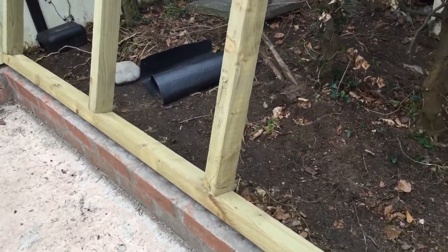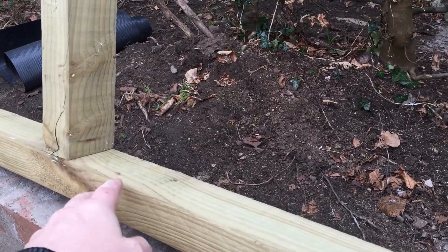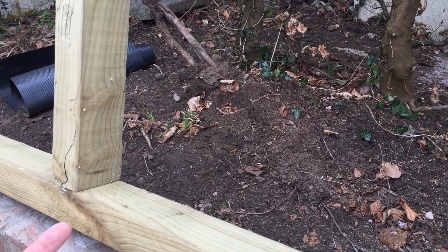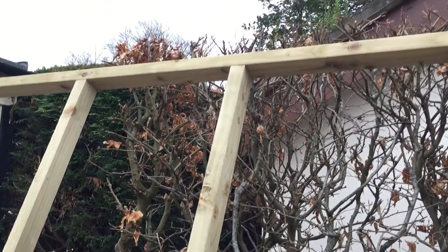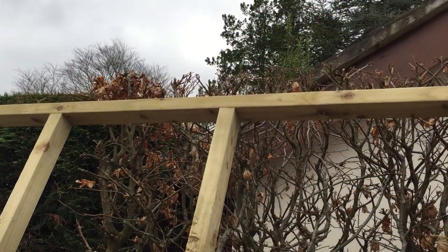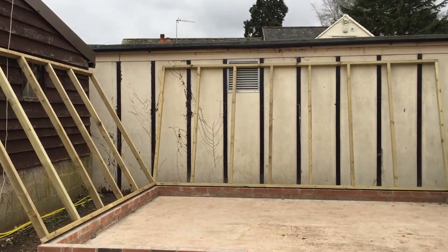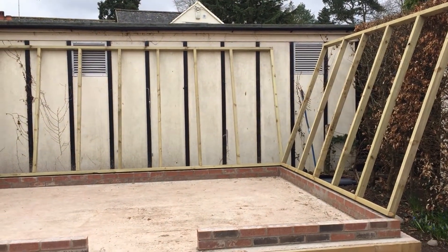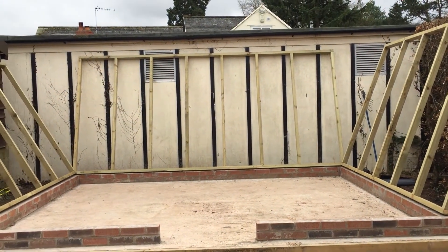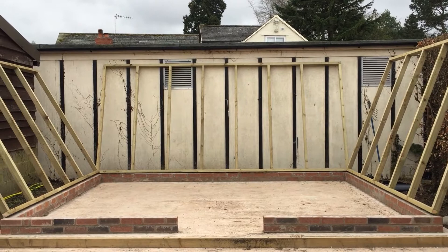It's been really easy to put together. The joins are just two screws coming through from the bottom up into the upright piece, and then up at the top I've just got two screws going down into the bracing battens as well. These three sides are just going to be screwed together and then screwed down into the brickwork. The next stage, which will be a little bit more complicated, will be to build the front piece and then the roof.